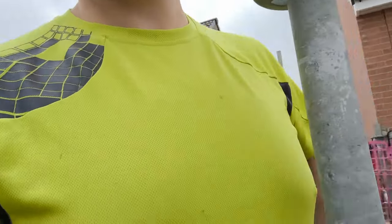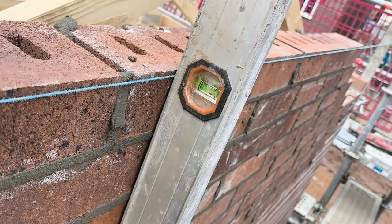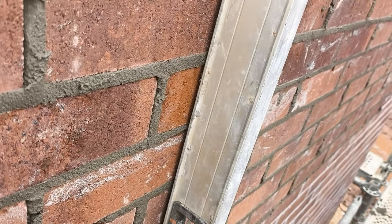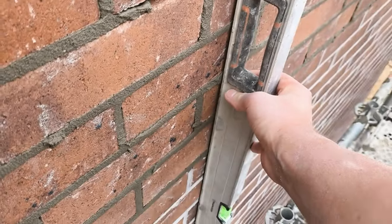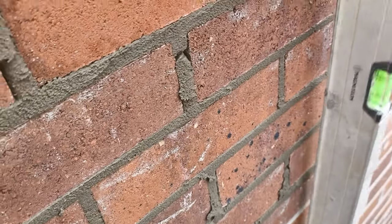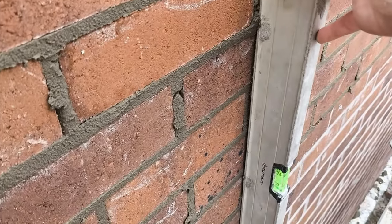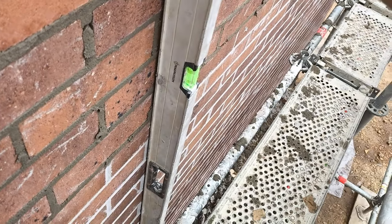I'll get my little level, well, my big level. Need a 6 foot level always, but 6 foot level, obviously that's plumb. Obviously I'm trapping the line there. You can always check, you can say, right, a line's thickness is plumb, so I want to ease my profiles out a little bit. A little bit all the way down. It just stops you getting those 10mm bellies or those 5mm bellies. See? Flat to the wall. Need to ease them out a little bit, but...